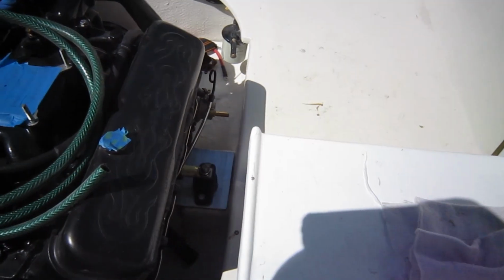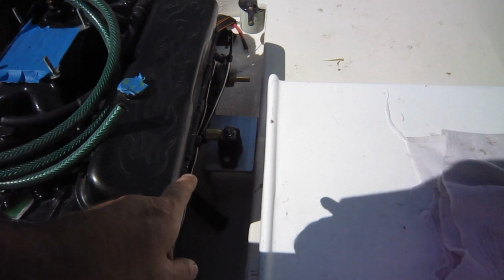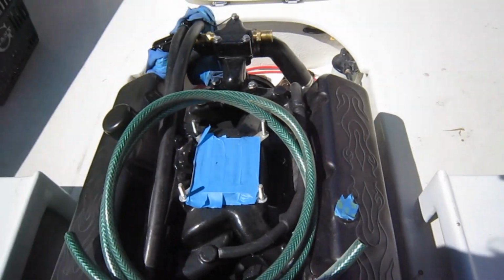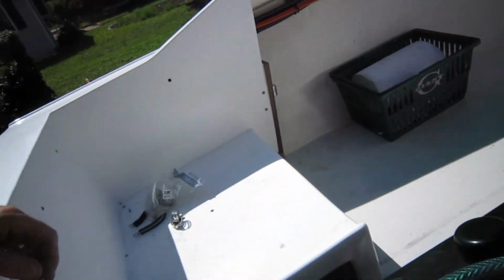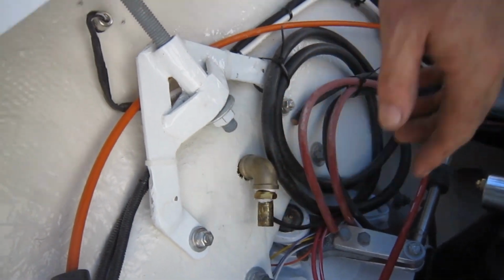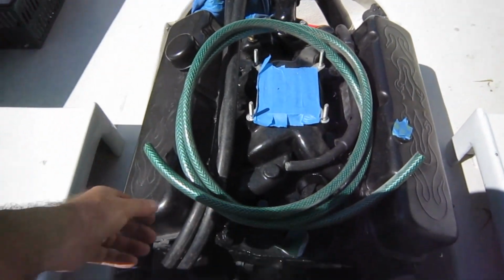We went ahead and got our nuts tightened on both sides. We got our lag bolts. Just an eighth of a turn maybe was left, probably from sitting in there. And we went ahead and got our water pickup all fixed up. We also, while we're at it, changed out this fitting here to a smaller one because the hose would not fit. It was a mistake that I fixed with stuff in the drawer.